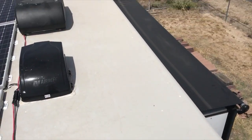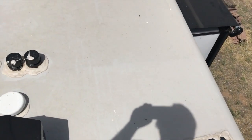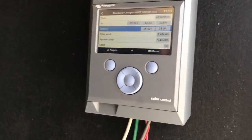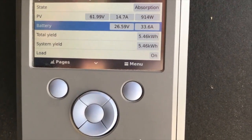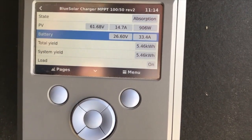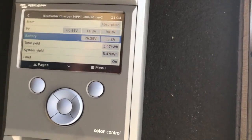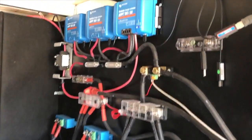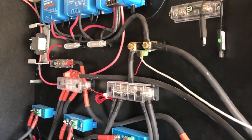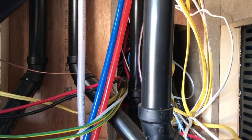I'm going to install another row of panels all the way back, skipping the skylight over the shower — should be able to get another six panels in. The sun is behind some thin clouds right now and I'm pulling 912–914 watts, bouncing around. Once it comes out from behind those clouds I expect to hit 1,100 watts or more. I've got my three MPPT charge controllers coming down into bus bars, which connect to the main bus bars through a fuse, and on the negative side through an amp meter.